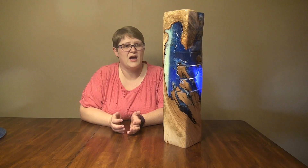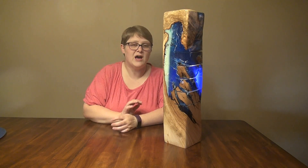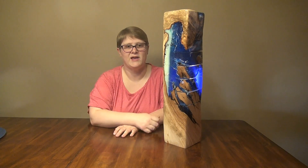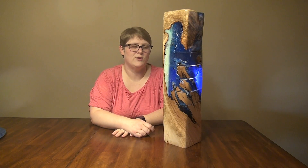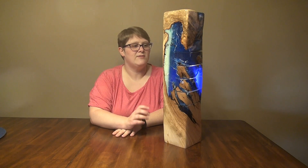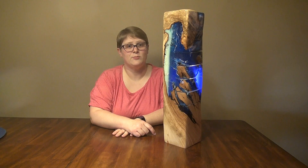Overall I am really happy with how this project turned out, though I did learn some lessons along the way. For instance, do not pour all of your resin at once, or you will get a crazy huge bubble explosion — especially since there were all those funky paths from the ants, meaning air was trapped within the wood and came out as the resin started to cure. In the future I know to do one layer at a time and take my time instead of trying to rush through it. Even given that, I am really happy with how this project turned out. If you like this video and you haven't subscribed to my channel yet, please do so you can catch all my videos in the future.